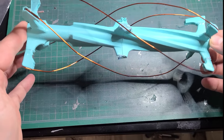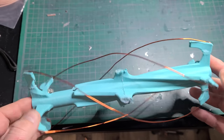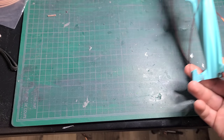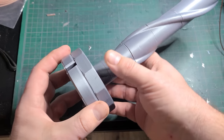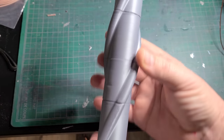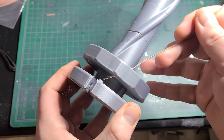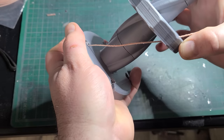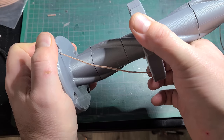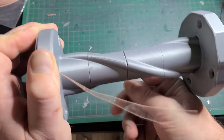After trying the QFH antenna for the first time, it became apparent that the dielectric effect of the plastic on the antenna had quite a big impact and I had to make a choice: either do away with the plastic, or take advantage of it. I opted to try to get rid of the plastic by using 3D printing to make a tool — a QFH antenna former — but there was a big problem. If you fed something into the former it would work in principle as you twist it and bend the wire, but the moment you passed the halfway point it would start deforming and actually pulling the conductor into the former itself, so that didn't work.